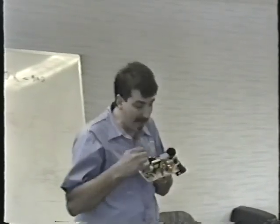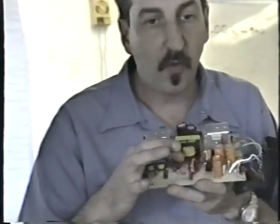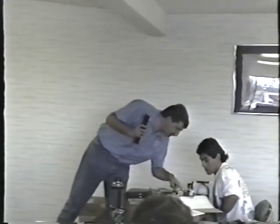If you look at your power supply, you'll see a pair of 3-amp diodes and a pair of 1-amp size diodes, like the diodes that I gave you in the class. The 3-amp size, the larger ones, and the 1-amp size. The 3-amp size are for the plus 12 volts. And right next to it, the 1-amp size over there, that's for the minus 5. We've got plus 12 and minus 5. Anybody not see theirs? Dustin, you see yours clearly? You know what I'm talking about, Tony? Right over here, right? Yeah, your plus 12s are there, and I guess your minus 5s are those two right in there. See those? Okay.